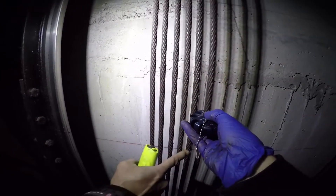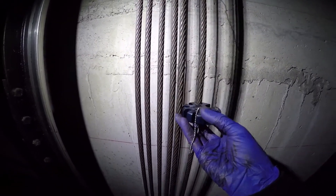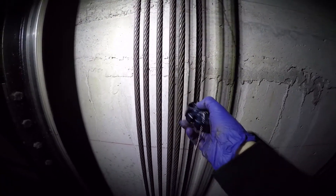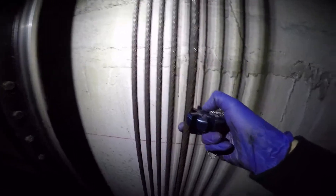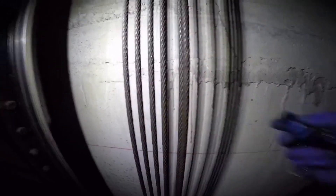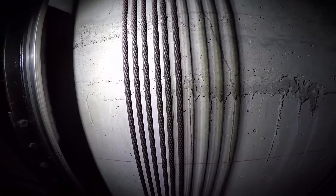I'm going to try it at a right angle and you see that it also fits this way. However, if there was no rouge on this rope it wouldn't warrant replacement, because the gauge does not fit on all the way to the end of the groove. We'll now proceed to another section where either there is more rouge or no rouge at all and we'll try our gauge on that.